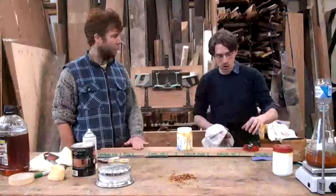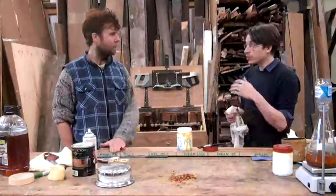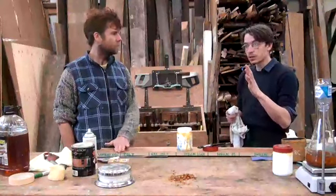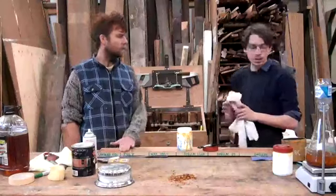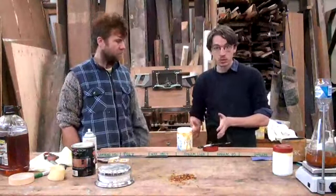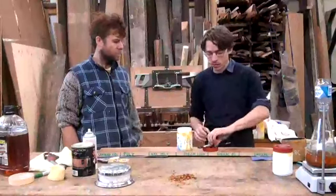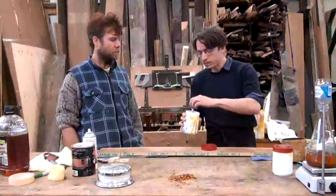Not always. Say with end grain, yeah. In fact, with end grain you'll get a much cleaner, polished result if you take the time to fill that grain somehow. There are loads of different ways to do it that I don't want to touch on. In this case, I'm going to attempt to just use the fine sawdust from the 320 paper, which works sometimes and sometimes it's terrible.